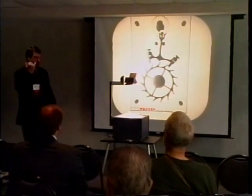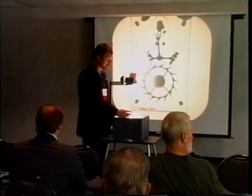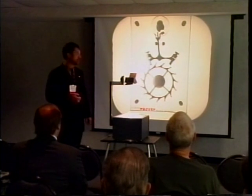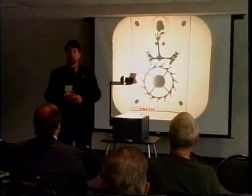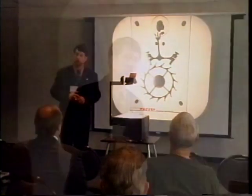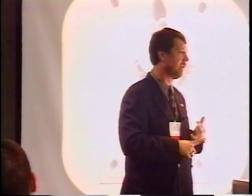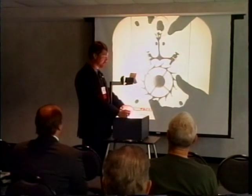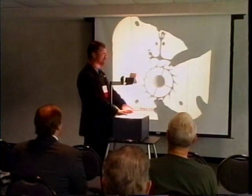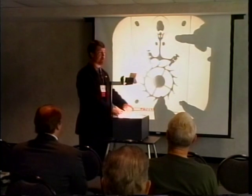If a watch receives a jar and you look at a watch and it comes in with the hairspring holding the roller jewel tight up against the banking pin, out of action, what usually caused that? Well, there was a failure in the safety action somewhere, whether it was fork horn or guard pin or whatever, the things that we talked about earlier. There are thousands of different problems it could have been. But my point is that what ties the roller side of the escapement to the pallet stone is safe lock.